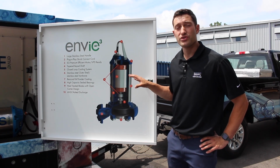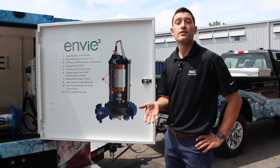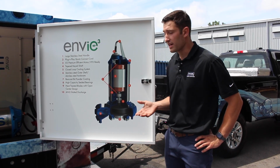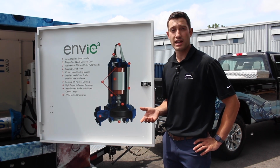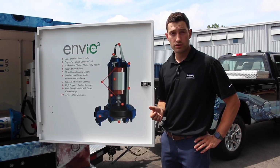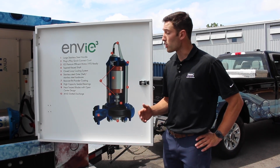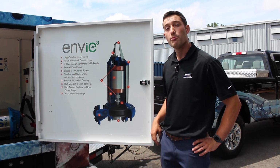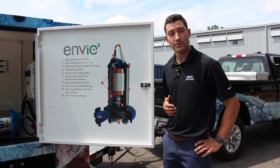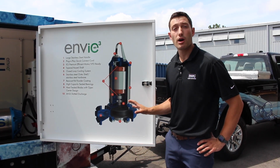Inside of this pump, we use non-proprietary replacement parts, seals, bearings, etc. Seals, for example, we use a John Crane Type 21 seal. It's a very standard, very accessible spring-loaded mechanical seal. This is something that we want the end user to be able to go out and get easily. We carry a good supply of them here on our shelves, and our channel partners will also carry a supply of them. But if the end user finds themselves in a pinch, we don't want to hold them hostage to our lead times. They can go out and have this part readily available and get their pump back in service.